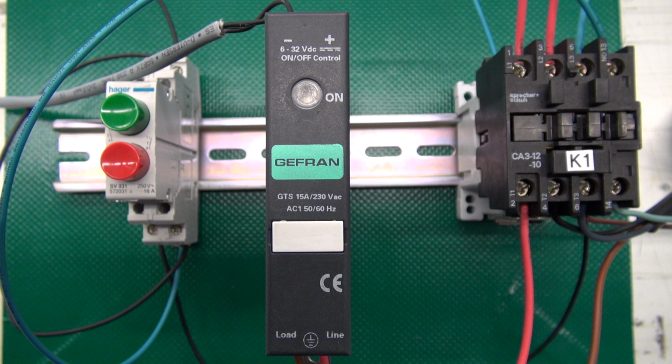An SSR switches the power of an electric wire on and off. It has no moving parts inside. Because of that, it has a very long lifetime. It switches the power on zero crossing. That means we have almost no electric noise. It can easily be controlled, mostly with a logic PWM signal.